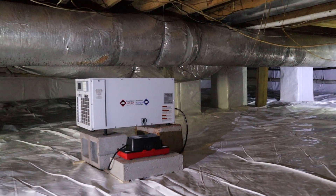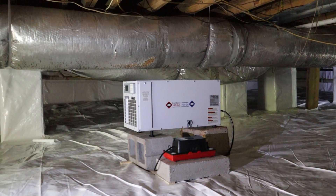Now, that being said, if you've got a crawl space that's fairly large — we've got some pretty large crawl spaces around Knoxville, 3,500 square feet — they've got big trunk lines of ductwork running all through them, chopping them up and making them difficult to circulate air. Then we believe that circulating the air is a good idea, and maybe in some instances installing a secondary dehu, depending on how large the crawl space is. If you've got a crawl space that's 3,500 square feet or larger, you may be better off with two April Air E70s versus one April Air E100 to make sure that the air is dry in sections of the crawl space.